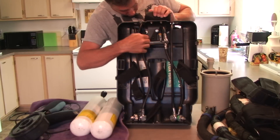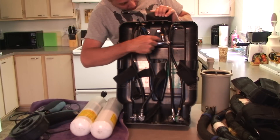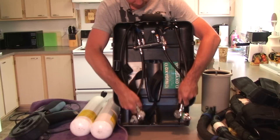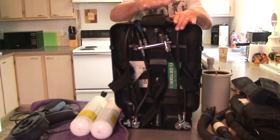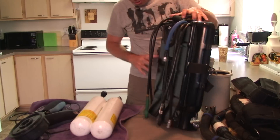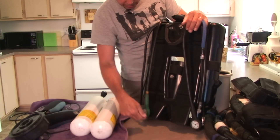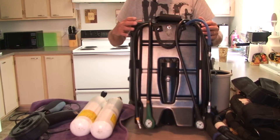On the inside there's a manifold, and the manifold has a little adapter here with a swivel. There's an extra one of these put on and it leaves a couple of empty holes in case you want to put a couple extra hoses in there. The regulators — I believe these are Apex 50s that come with the Inspiration — look in great shape, no corrosion or anything. There's the hoses and those all look clean. There's a weight and trim pocket on the top so you can put some weight in there and trim yourself out. All the hoses are here to plug into your add valves and into your BC. There are the SPGs, one for oxygen, one for diluent, and they're colored so you can tell which is which.